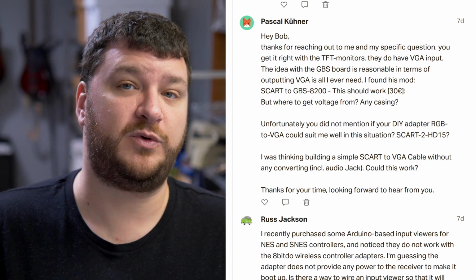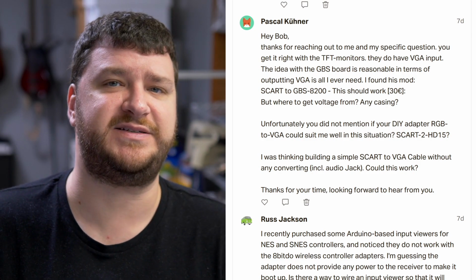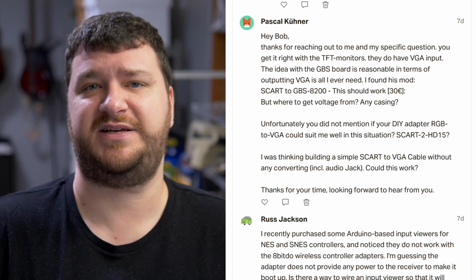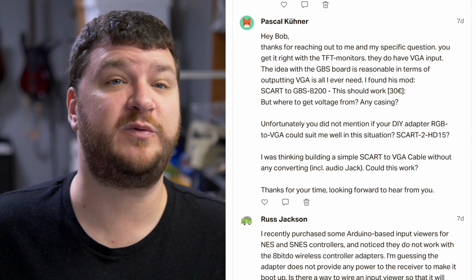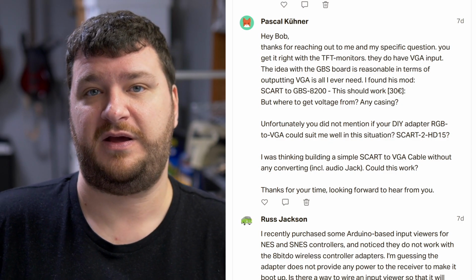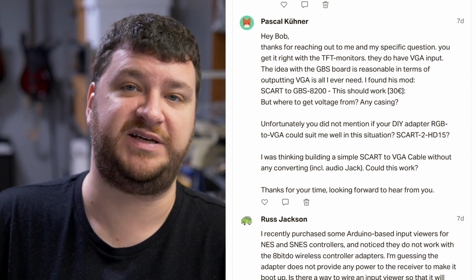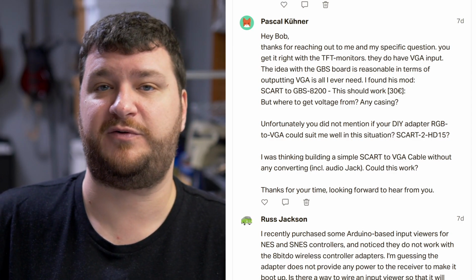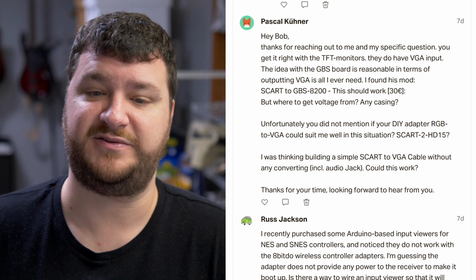But if it doesn't work, or if you don't want to build that, you can get any devices like the Sync Strike, the Sync Slayer, the Sync Baby. I don't know. There's a whole bunch of them, and some of which are even open source too, that take a SCART input and then run it through not only a pin conversion, but run it through a sync stripper that gets rid of all the other information on the sync line and boosts it to TTL level sync.